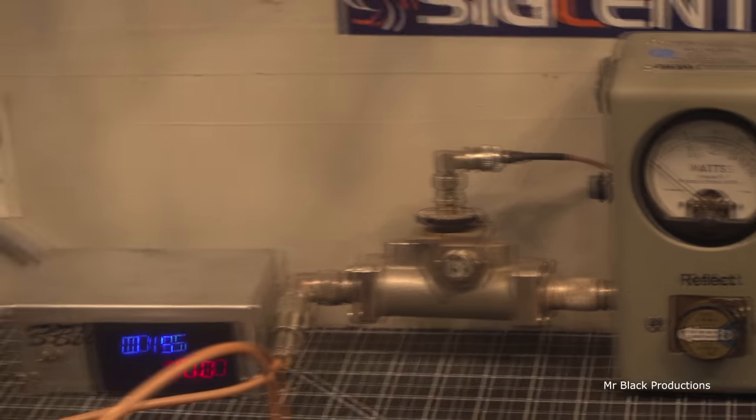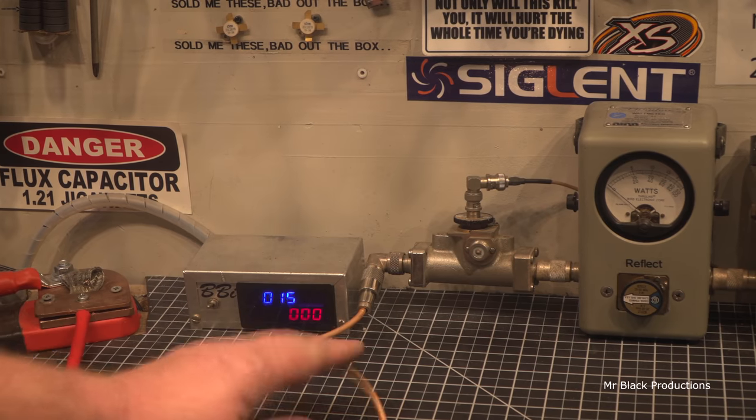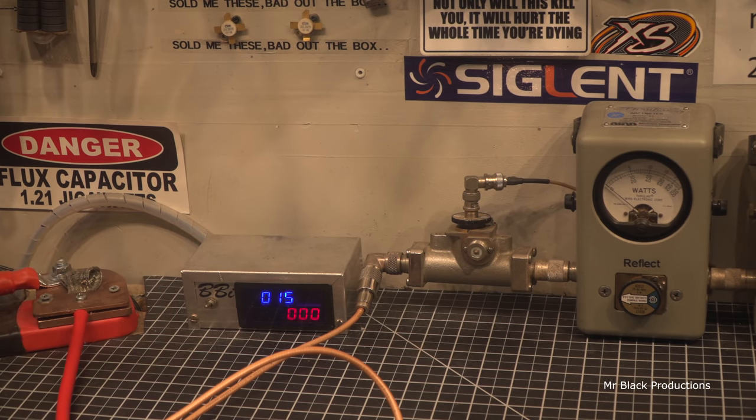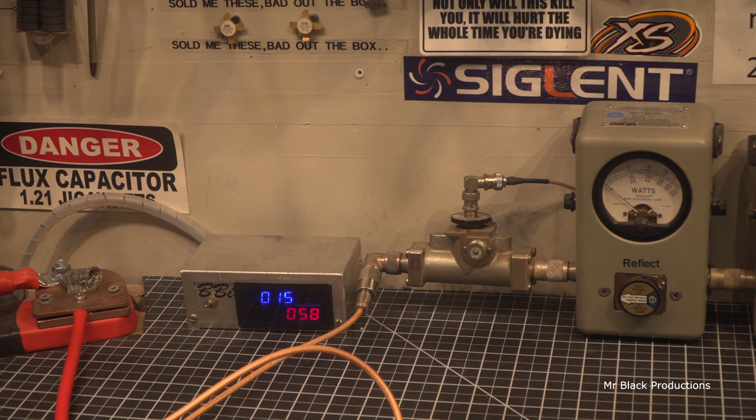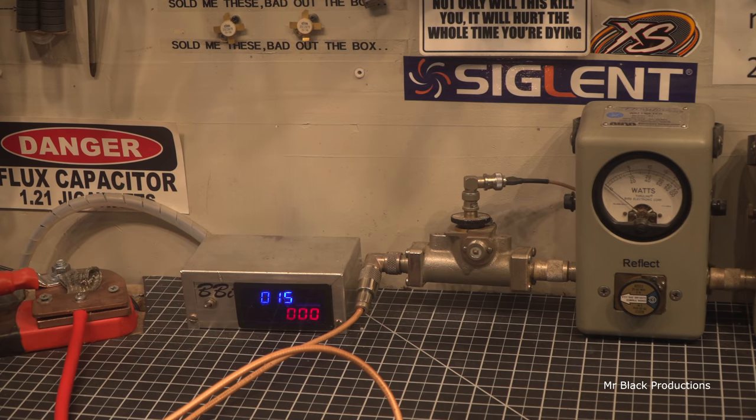Now, I've seen many, many, many posts here in the last couple days about this topic. Oh, let's look at the amp gauge. So this is an average reading meter. Okay. So peak, we're going to times this by roughly about 2. 60 amps is what we're pulling, and that's only with 20 watts of drive.